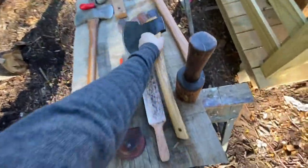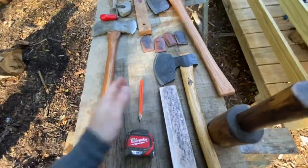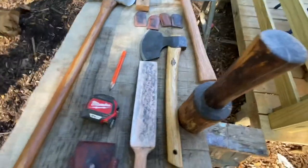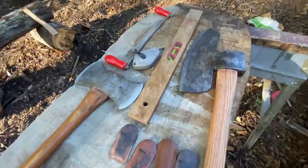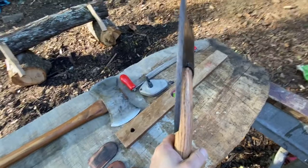So if you're purchasing that axe, or maybe I'm mistaken, just make sure that you get the flat side towards the log that you're hewing. And then you can flip it over, bevel side towards the log as the situation may require. But you really do want at least, you can make do the other way, but you at least want the flat side towards the log.